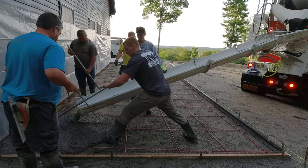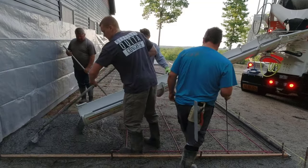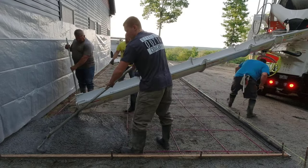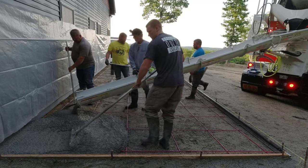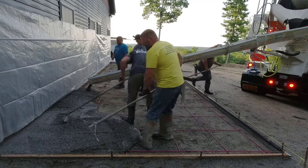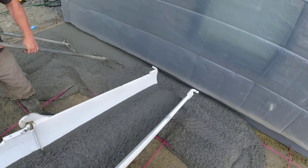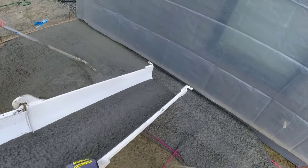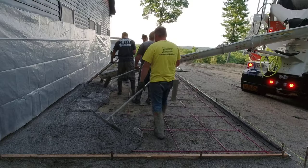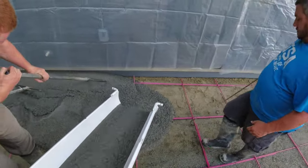In this video I wanted to go over how we set up. The homeowner actually did the forms in here. We did the rebar. We put the poly up on the house and got iso-strip up against the house foundation — a half-inch piece of foam so the concrete patio slab doesn't stick to the house slab. We like using fiberglass rebar, tied at a two-foot mat on center.